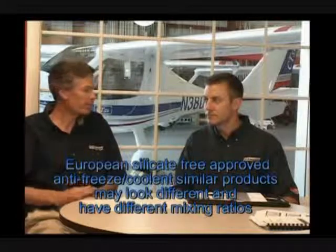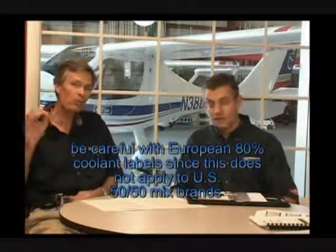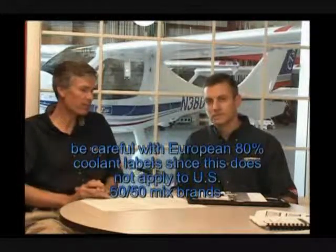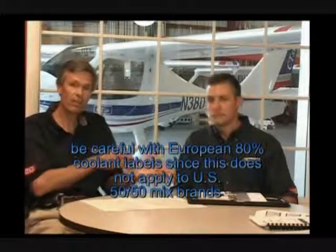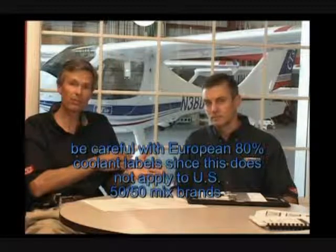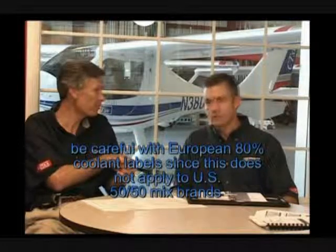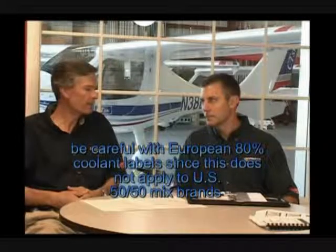And the other thing is, we've seen with some of the airplanes, like the Tecnams, for example, they specify 80% coolant, 20% water, which the European coolants tend to be of a different consistency, and so you do use less water. If you were to do that with one of the U.S. coolants, that would be a big problem, because you're going to have gelling within the system. You don't want to use more than the maximum ratio recommended by the manufacturer. Typically 50-50 is the norm, and that works well.